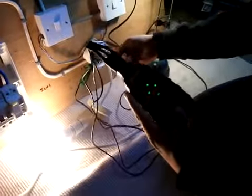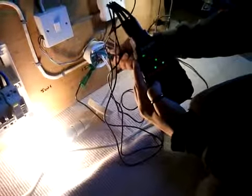And because we know the light is off, we turn the light on here, which then goes through self-test. It gives you three green lights and a voltage indicator of between 207 and 253 volts, otherwise 230 volts. We need to now test out the loop, so we press the little button, let it do its work. Then it comes up with less than an ohm around the loop, which is fine, and the three green lights are correct again. The last test to do is polarity, which is just hold onto the button and the green lights just continue to flash.